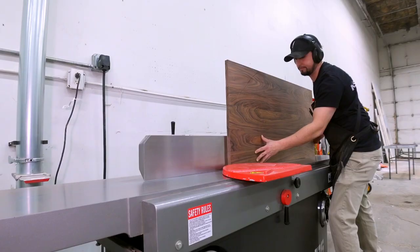There's my favorite board. Up until this point, I produced panels that were roughly 24 inches wide, and I need to joint some of them together to create the two halves of the tabletop. I will be doing inlays though, and don't want to be reaching over the giant slabs to do my inlay work. So the solution is to dry fit them together without glue. That way I can continue the rough shaping process, then I'll pull them apart when it's time for the inlays.